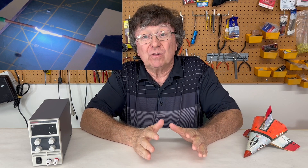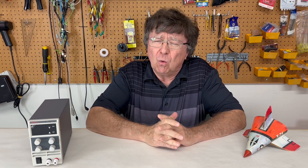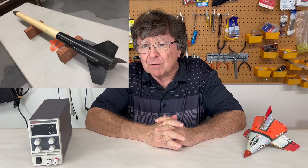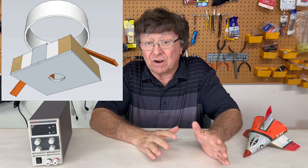What's next? First, a repeat of MHD-131 with the data logger and electrode problem fixed. Then we'll start testing using our new more powerful coil at 90,000 volts and above. We also want to experiment with a two-stage electrode configuration. We've already started getting rolling on our RF pre-ionization enhancement experiments. We're also already working on mounting the whole thing on a small sounding rocket. We've learned from our high-altitude program that it's never too early to build flight hardware and learn from that.